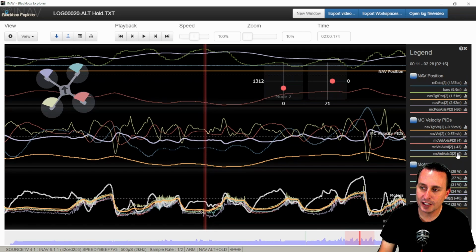Next, you have the P term, the I term, and the D term. So hopefully you're familiar with how those work and all the variables. And if you're not familiar with PID loops and how that all works, I'll drop a link down below. You've got to check out my short video at uavtech.com/tuning. There's a short video on how those terms interrelate to each other. It's key to know that. Obviously, they work just like any normal PID loop: the P term is trying to push these terms together for sharp inputs. The I term is, over steady runs, trying to get that to match each other.